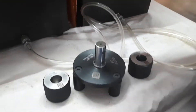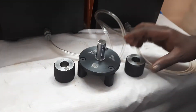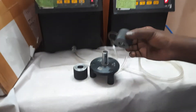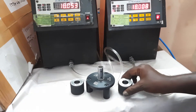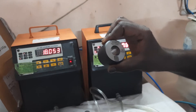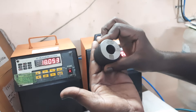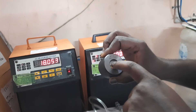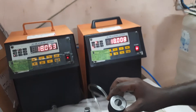This air plug gauge is ready for inspection. We have done the mastering and I'm going to show how it will work. This is the bore — you can see this is a through bore. In some cases it will be a blind bore. Whatever the case, ultimately we want to measure the bore diameter. Let's go for inspection.